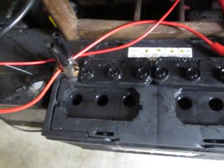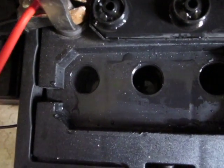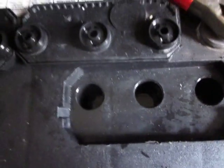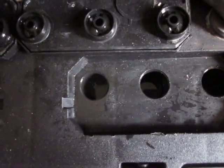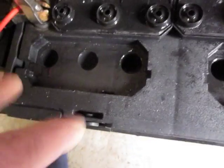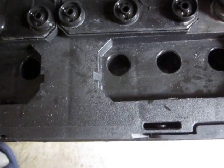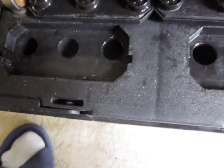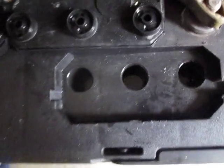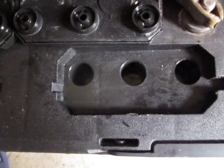I'm working on this battery right now and it's working pretty well, except there is one cell in the middle which has been quiet. When I started with this battery, only one cell was responding and gradually all three started responding. The electrolyte was turning brownish, which was the sign of sulfation being knocked off. Right now it's settled at the bottom so the electrolyte is much clearer.